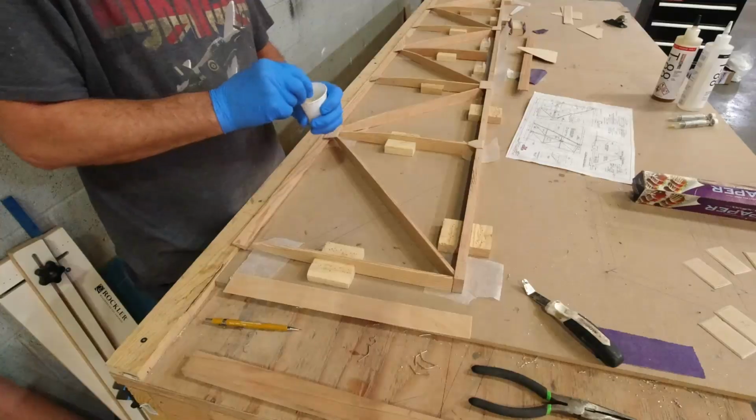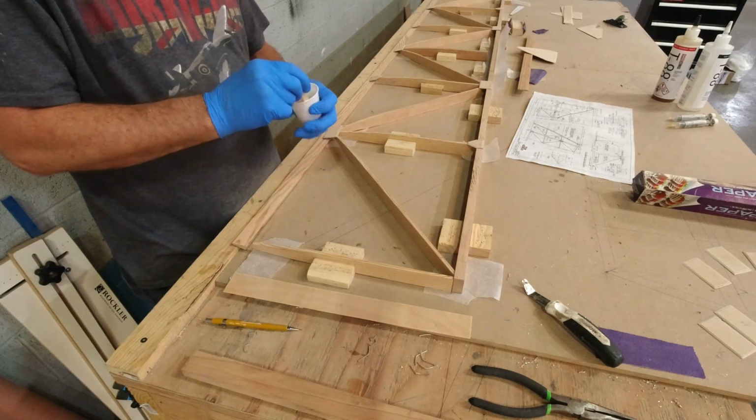this all stapled together. And like I said, I'm going to try and pull it out of the form after I get it stapled, and flip it over and do the gussets on the trailing edge. Instead of trying to weight that down or anything, I'll just go ahead and put those in place, since I've got them all prepared. Oh, actually, before I mix the epoxy, I've got to put this kind of back together and then mark where each of these goes, so that I can see where to put the glue. All right, so I'm just mixing up the epoxy here.